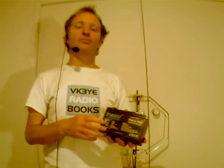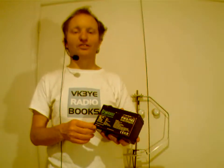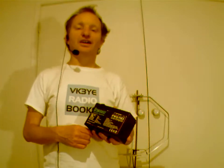So with your power budget, you basically guess what proportion of the time you're receiving and what proportion of the time you're transmitting, work out how much power, and then you can work out the battery capacity that you need from that. And make sure you allow a lot of extra fat. You don't want to be stuck up on a summit or on holiday or whatever and be running out of power. So take maybe double the battery capacity that you calculate you need.